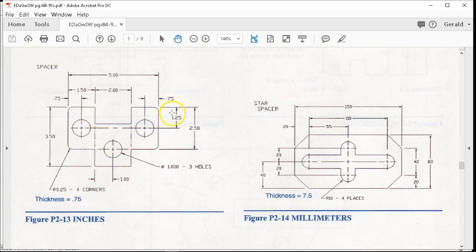Pretty much same thing. We're going to draw half. Choices: do I include the fillets in the sketch, or do I make them as separate features? Either way, you're going to end up with geometry. On the one side, it's a little bit easier to create the feature fillet, and the only real rule is feature fillets are last. One of the reasons is that fillets aren't typically toleranced and dimensioned in the same way that I would for the overall size. And if you happen to grab the edge of a fillet to dimension to some other piece of geometry, and that fillet is 120 or 130 instead of an eighth of an inch, you're potentially shifting your geometry.